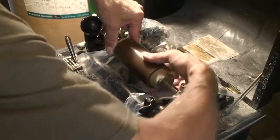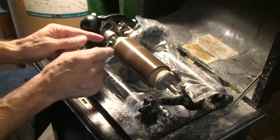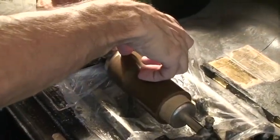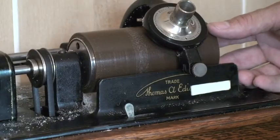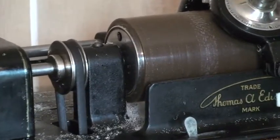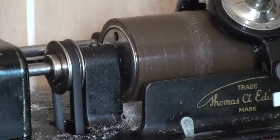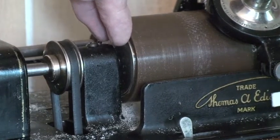What you watch for is with the cylinder on the mandrel with the sandpaper, you look for this gap here to close up to about a half an inch. Once that's a half inch, then without the sandpaper it's going to stick clear off there about seven sixteenths. Then you go over on the Edison and push it on there and it lines up exactly with the end of that mandrel. We started with the gap being about three thirty-seconds and after one more reaming it's dead even with the left end of the Edison mandrel at about seventy-five degrees.